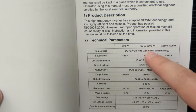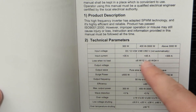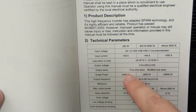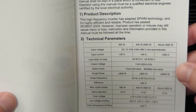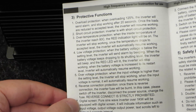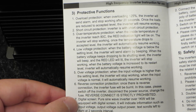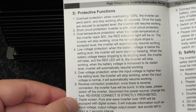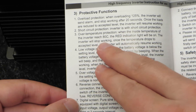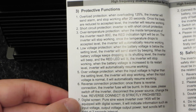They have a table in here — I don't know if I fall in the 400 to 3,000 watt or above 3,000 watt category. It lists input current as less than 45 amps, which is just nonsensical gibberish. They have ratings for pure sine and modified sine in the same table; the information is worthless. Under special functions, they state that you can overload it to 125% and it will sound an alarm and stop working after 20 seconds. So does that really mean I can get 3,500 watts out of this for 20 seconds? I kind of doubt that, but we'll see. They also list over-temp protection — that's way too high and there's a good chance it'll fry before that trips.